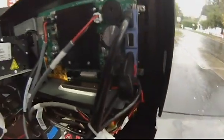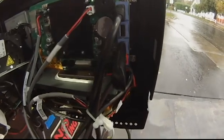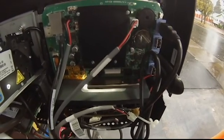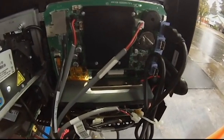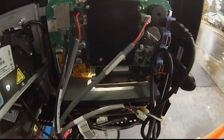You can see currently I've got a thumb drive in there. I'm actually loading the OS application for the iXpay. The units come with the software on it, but should you have to replace a unit as I'm doing today, it will not be shipped with software. So you have to configure a special thumb drive, put it in, reboot the unit, and let it sit for 15 to 20 minutes, then remove the thumb drive and power it down.